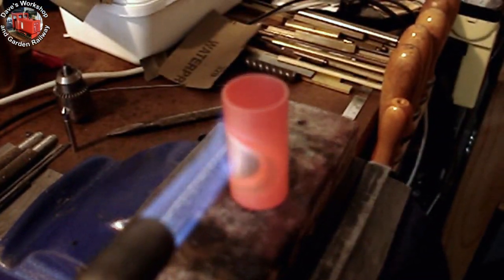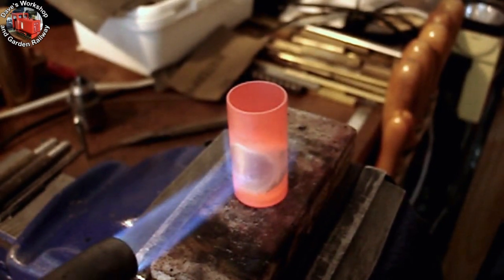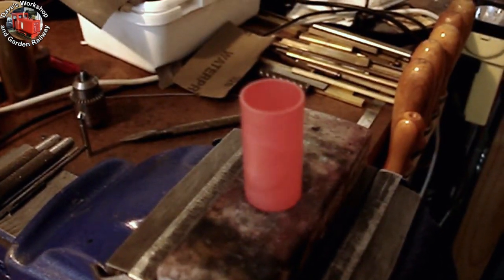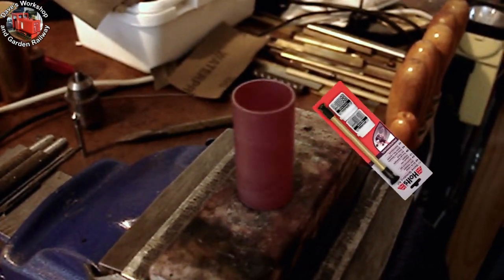The bond was good, withstanding turning and lapping. The copper was turned to size, about a thou undersize, as allowance must be made for the abrasive particles. I used the top slide for the turning, making the rear one thou larger than the front. The copper turned nicely with a sharp tool.